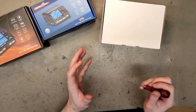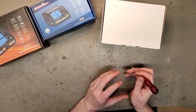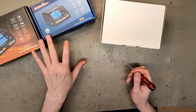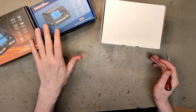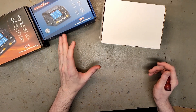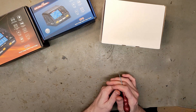I've been looking around at all the hobby chargers and dischargers to find what's best, and many — or most — of them do not discharge 1S battery packs. Since we test many singular cells, they are simply worthless. Most of them also have very low discharge, like 20 to 40 watts. That is way too low for us.